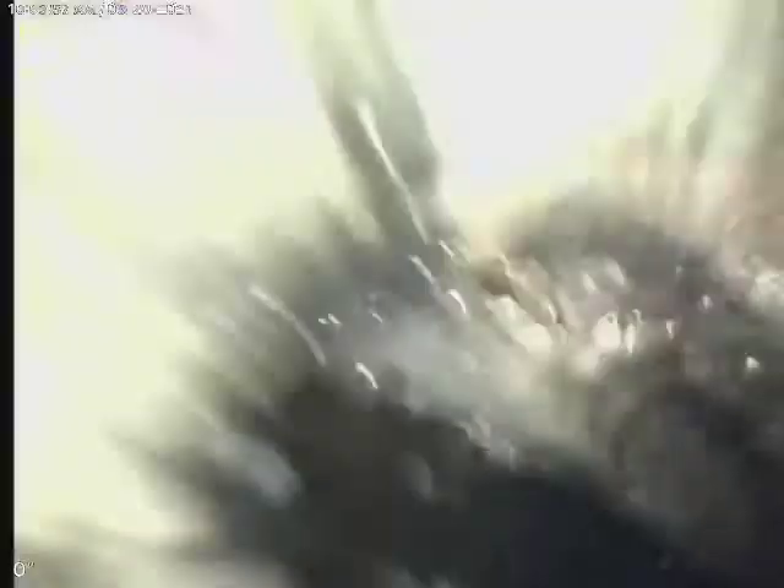This was the only clean-out for us to go through. We're coming back to a smaller pipe here where there's a lot of grease in the line — the kitchen line. We could only get our little teeny micro-camera in there. You can see it has a little bit of grease, but it doesn't look too bad. We couldn't get our small camera in further because it was a little choked up, especially around this area. It gets a little choked up — that's a kitchen line, very common and very normal.